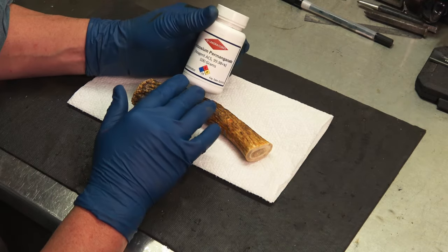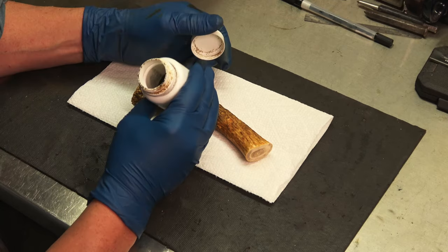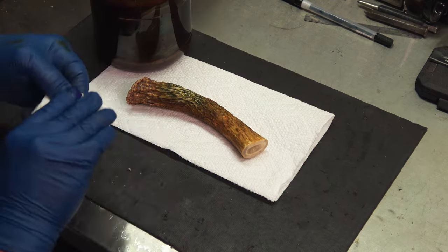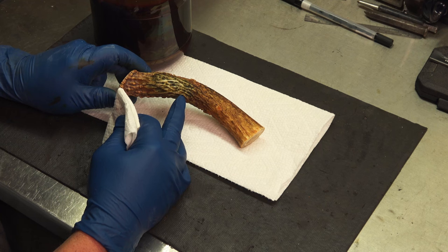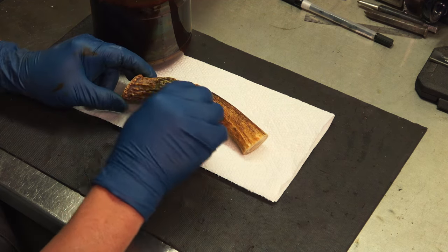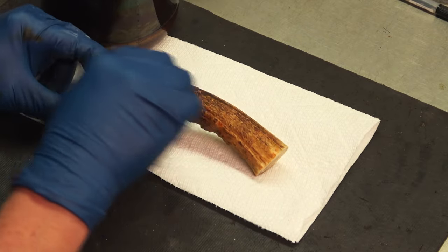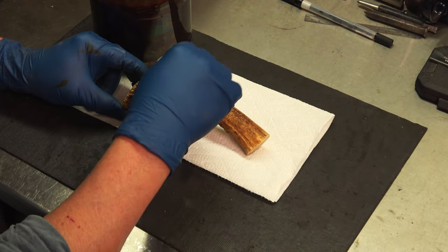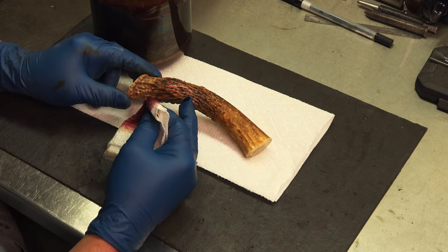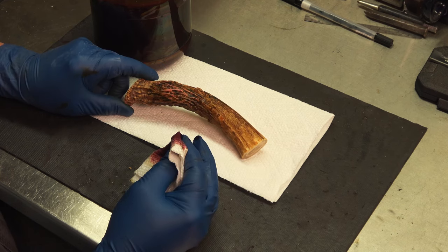Now it's time to do the dyeing of the whole antler. What I use for antler dyeing is potassium permanganate — I'll leave a link in the description where you can get this. It's a powder form and I use a small amount to water, a teaspoon in this jar of water, so you can experiment with the mixture. It takes a very small amount. This stuff will go on and it'll look maroon or red, but don't worry — as it dries it'll turn brown. First time I ever used this I was like, 'Oh, I ruined it.' It'll turn brown. I'm really saturating it and doing this spot first to try to start blending it out. You'll have to use several coats to get it to the color you want. I'm going to start dyeing the other antlers that don't have any carving on them too.